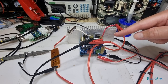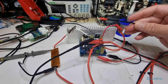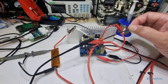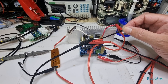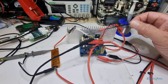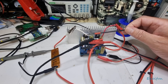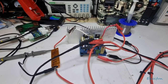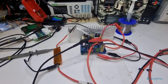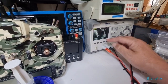Now, there's no way of adjusting the quiescent current on this — there's no variable resistor. That suggests to me that the quiescent current is fixed. If it's 30 milliamps and you've got that big voltage range, as the voltage goes up and temperature goes up the quiescent current will rise. So I'm not quite sure — we'll have to peek at that. It's easy enough — we can just look at the current over here. Let me put it into tracking mode.